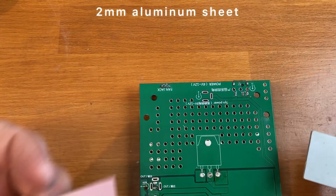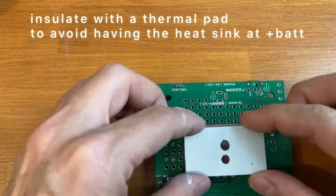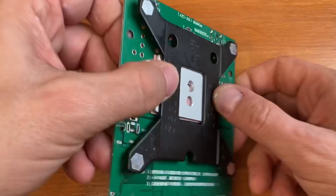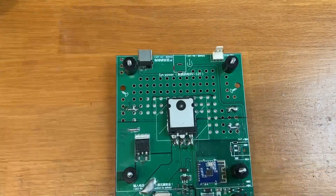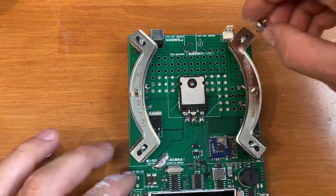Let's mount on the bottom a piece of aluminum to reinforce the PCB. I will also place a thermal pad so it is electrically insulated. Use the Noctua heatsink holder instead of the original one, which is made of plastic and is not strong. I used the four black spacers from the Noctua fan — all the hardware mounted is taken directly from the Noctua box.